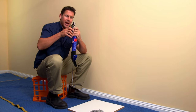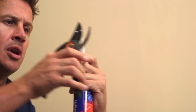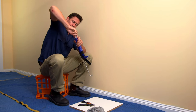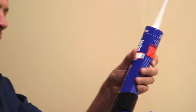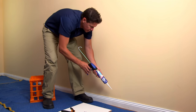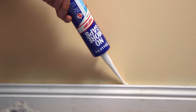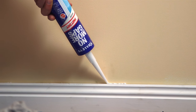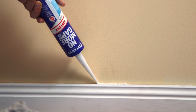Just snip the top, then with the nozzle, chop it at a 45-degree angle — not too thickly — and screw it on. Pump the gun and we're ready to roll. On a 45-degree angle, push the nozzle right into the gap and dispense the product.